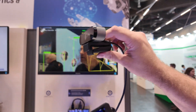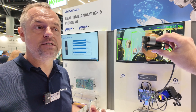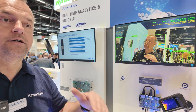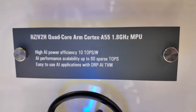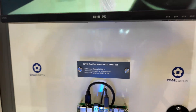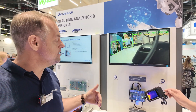In addition, we have the so-called pruning technology. Pruning means we thin out the neural network — weights which are not contributing to the accuracy are set to zero. With this technology we can scale up the performance up to 10 times. For example, we have up to 80 TOPS in sparse mode using this pruning technology. In dense mode with the complete neural network we have 8 TOPS, which is already 10 times the previous generation.